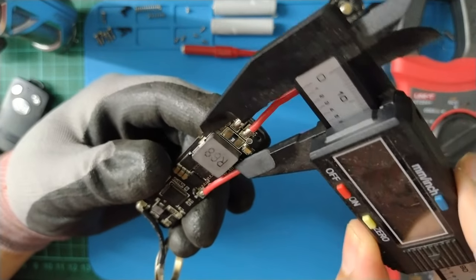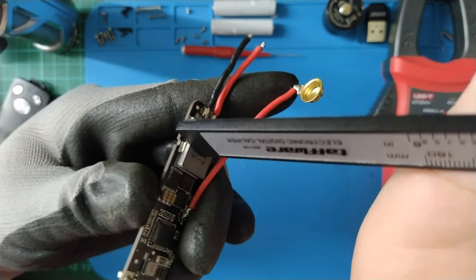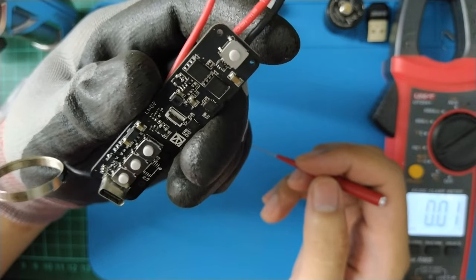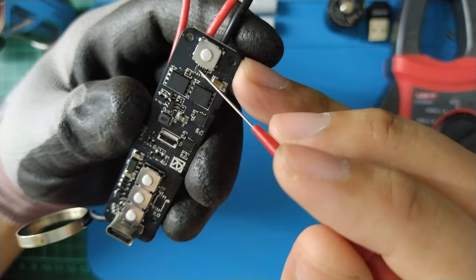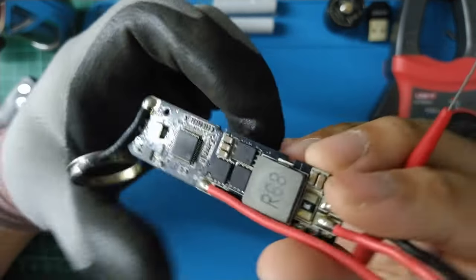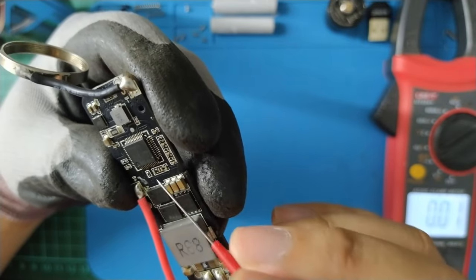I will try to measure the inductor size. The inductor size is about 12.5mm and the height is about 3.5mm. There's an op-amp for measuring output current and detecting coil resistance, which amplifies the voltage signal from the shunt resistor. There's also a thermistor for measuring the PCB temperature, but I'm not sure of its exact location — maybe in here.